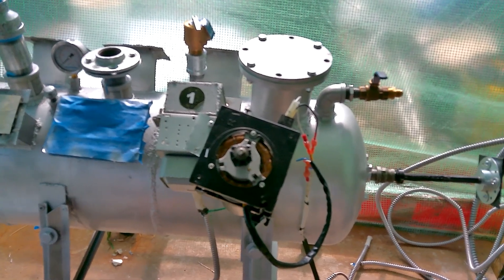In hindsight, the reason why the pressure explosion happened was it was just a vapor explosion, and it was because I had a ton of leaks all over the place. I used the mica as waveguide covers, and basically as soon as it crumbled it just shot out a ton of pressure. Even in the video it looks like the water bubbler exploded — it really was just the sound of all the pressure leaving that mica sheet at one time. So once I solved that issue, this never happened again.